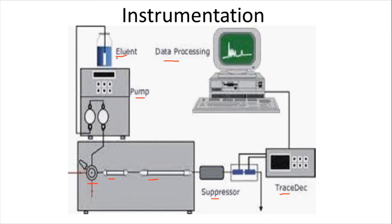Starting with the eluent — we use extremely varied pH ranges of eluent. The reservoir is made of stainless steel, or sometimes glass, sometimes polyester, or polyether ether ketone (PEEK) material. We use these materials to prevent erosion of the eluent reservoir surface. The eluent is then pumped from the reservoir to the injector.